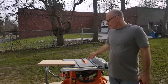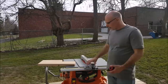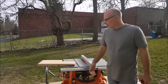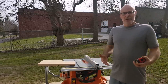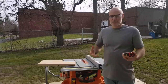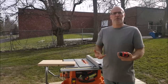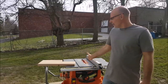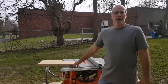We're going to start with the blade at the height of the full depth of cut, which is at the bottom of my table leg, and progressively move the fence in eighth-of-an-inch increments, lowering the blade accordingly, walking our way along the surface. Once we've moved seven inches, our blade will be back down into the table and we should have the correct angle. In my last video I had the blade at 90 degrees to the table because we were doing a contour surface, but that created a lot of steps to sand away. Since there's no contour to this cut, we can tilt the blade to the correct angle so the teeth are parallel to the surface we're cutting, and we should have very little stepping and very little sanding when we're done.